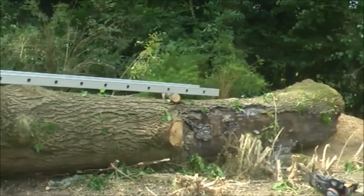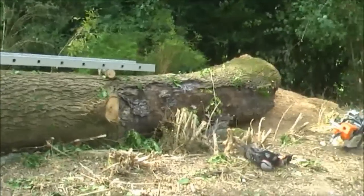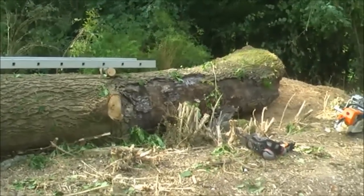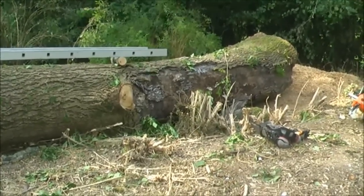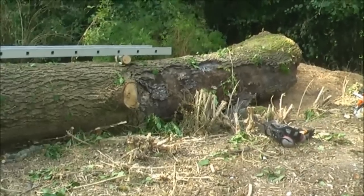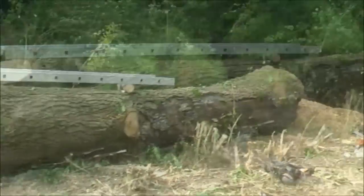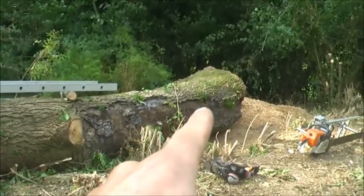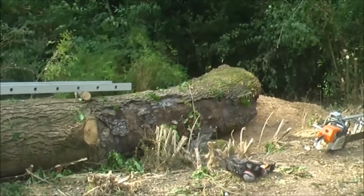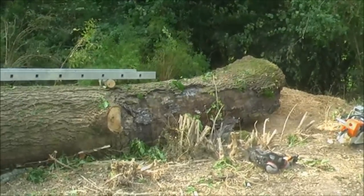There's a nice ash butt there and the brief for this tree is to make a large dining room table, straight out of the log, ready to go straight inside green. First thing, you can see there's a big flare at that far end of it, so I'll knock that flare off and then we'll get a level on the log and see how it looks.